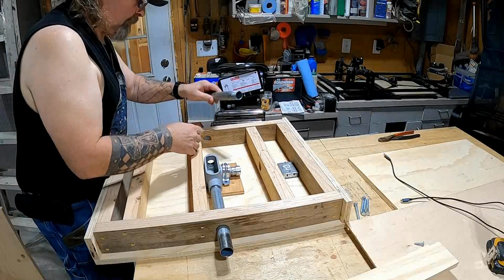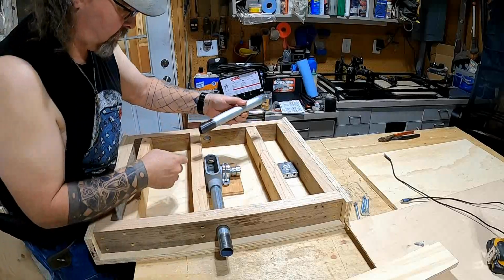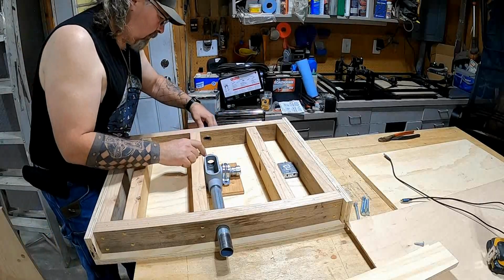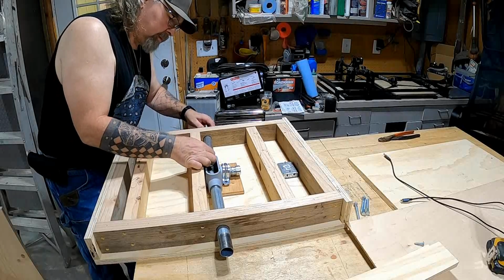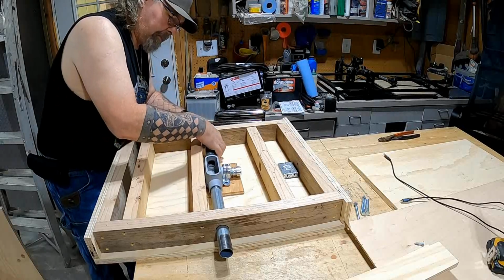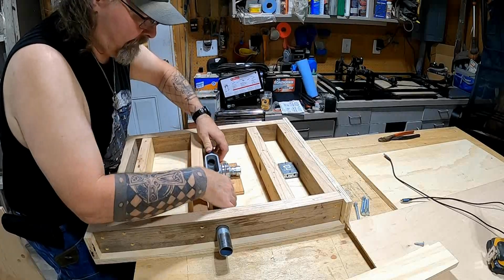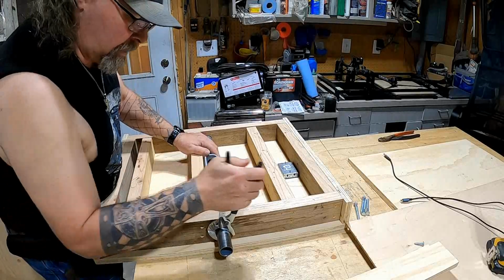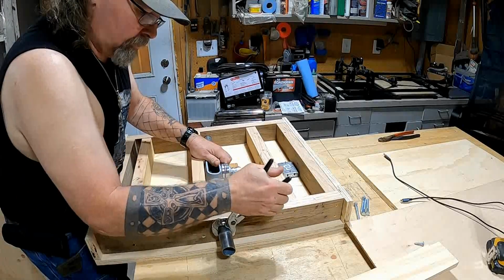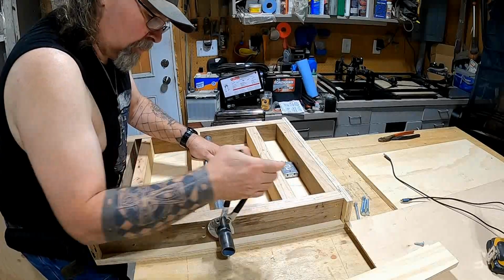So you'll notice that the threading on the conduit, one is a little longer than the other. The short one's a standard thread, and I cut the other ones longer so that they would be able to go through the sheeting on the sides and the uprights on the sides, so that I have room to get a lock nut on both sides of the top and both sides of the sheeting for the side supports. I chose to go with the receptacles on the outside that I can access,